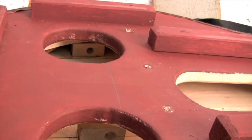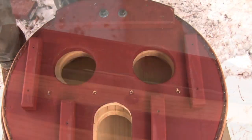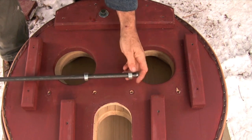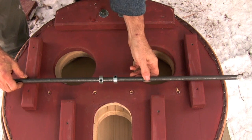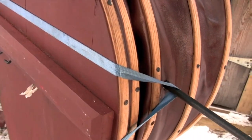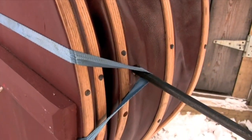Here you can see two of the support blocks. The one on the outer edge of the bellows is sitting just underneath the floating rib. The block in the center is really just used to lock the bar in place. Here I have the new support bar — once again it runs through the entire width of the bellows and out both sides. As I insert the bar through the bellows I need to slide on some locking collars that I'm going to use to keep the bar in position, one on each side of the center block. Once I have the bar in position I'll use an Allen wrench to lock down the collars, which will prevent the bar from sliding out of position. I slid the bar into position and used a ratchet strap to apply the clamping pressure until the glue set. Of course you won't need to do this if you decide to build a bellows — you'll be able to glue these blocks in before you close everything in. But it does illustrate the value of the access hatches.